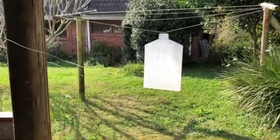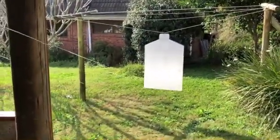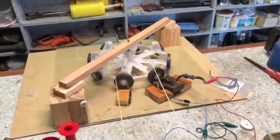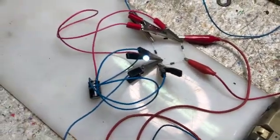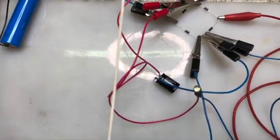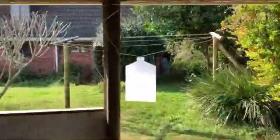You can just add a lot of these around and multiply the voltage that way. I've decided to do a little experiment — I hung this piece of aluminium in the wind connected on a couple of strings, and the strings run to the magnetic rotor. As you can see, it's generating power just from the magnets moving back and forth; the strings are just jerking back and forth from just a slight breeze outside.